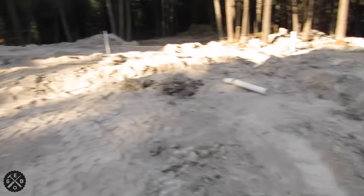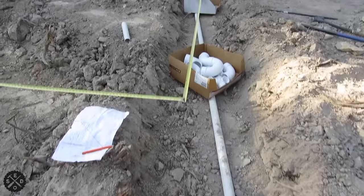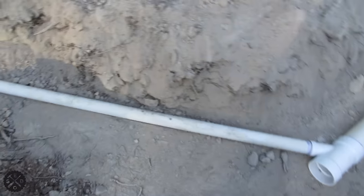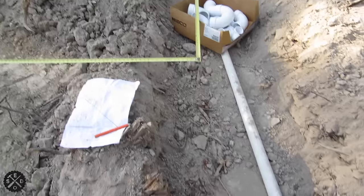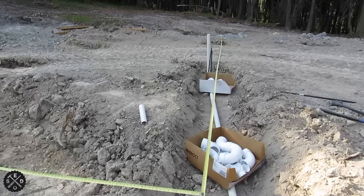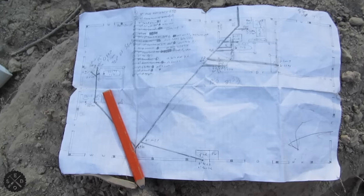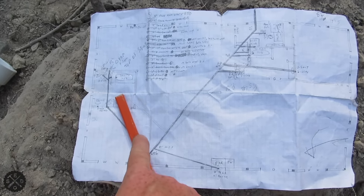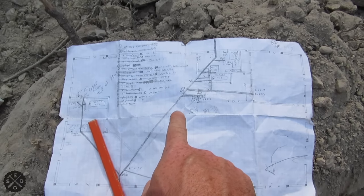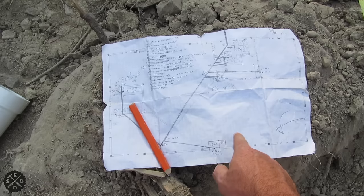You're probably wondering how I get the plumbing layout. This line is coming down here and winding off to go to the bathroom vanity, and now I'm getting ready to do the toilet which is right here. The way I do it: there are two tape measures, one there and one here, and I have my drawing. Basically I did this vent bathroom section first, and this line comes over to the bathroom. It was just easier to dig it that way with the Y and everything. The toilet's going right here.